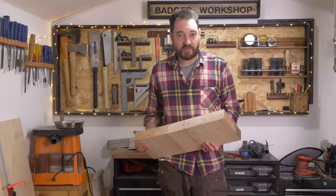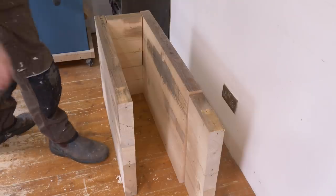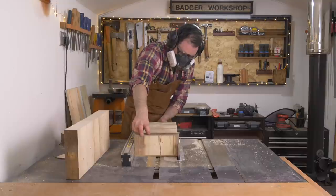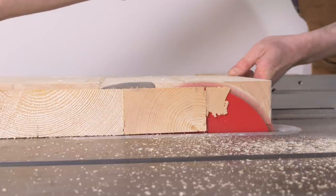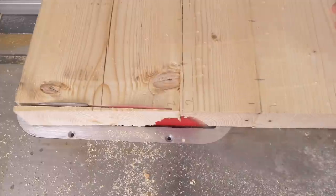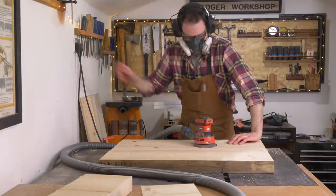This project's been a little tricky because of how thick the material is. Normally I'd have glued it all up as big panels and then passed it through the table saw, but it's far too big and heavy to handle. The other way would have been the track saw, but this wood's too thick for the saw I have, so I've glued it up into smaller panels. The trouble is I now don't have nice straight sides, so I've knocked up a little jig to trim the sides on these smaller pieces flush — one side using the jig, the other side running along the fence. The bigger panels I'm just going to leave rough and sand flush afterwards.